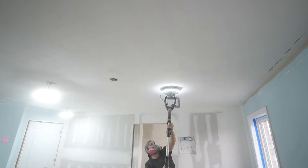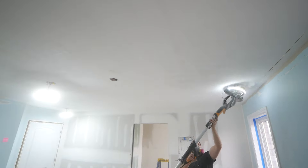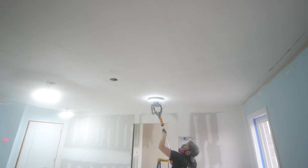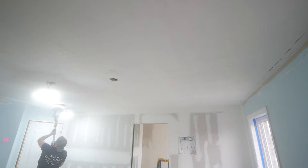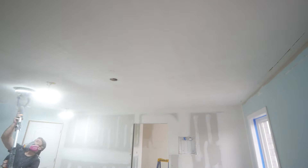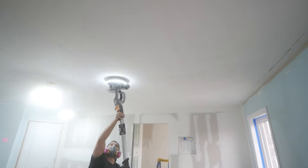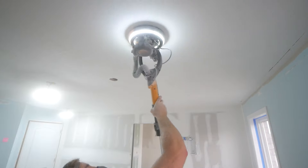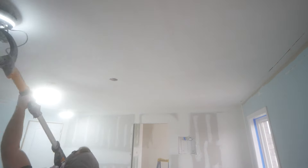Now this is a dusty process, so if you want to mitigate how the rest of your house reacts to this, you can shut the door, plug up any ducts in the room or space, and if you have windows you can open them and even set up a negative airspace. That would be if you have a box fan, for example — you could put it in the window and simply pump all the dust to the outside.